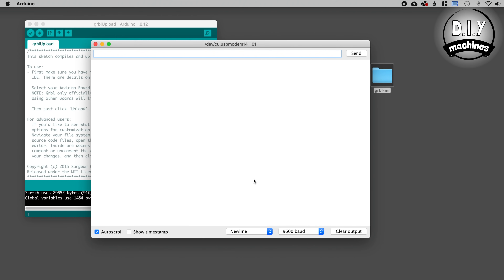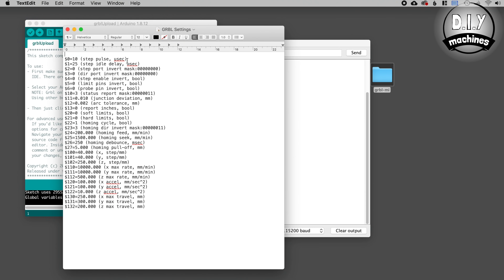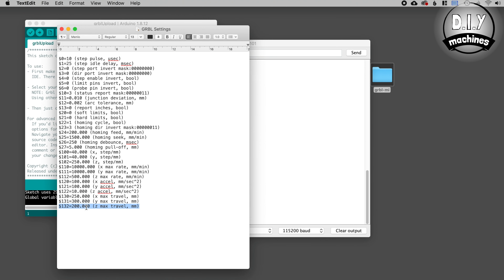Once the upload is complete you can open the serial monitor and set the baud rate to 115200. Sending two dollar signs should return GRBL's current settings. To begin with we will upload a set of configuration settings for the design as I have built here and have shown you in the first video. We will use this to check that the motors work properly and that our limit switches are responding as they should. I have put a link in the description to where you can get a copy of these configuration files. Copy and paste the settings line by line into the Arduino serial monitor and they will automatically apply themselves to your GRBL installation. You can verify this by sending the double dollar signs again to see the current configuration, which should be different to what we saw earlier.